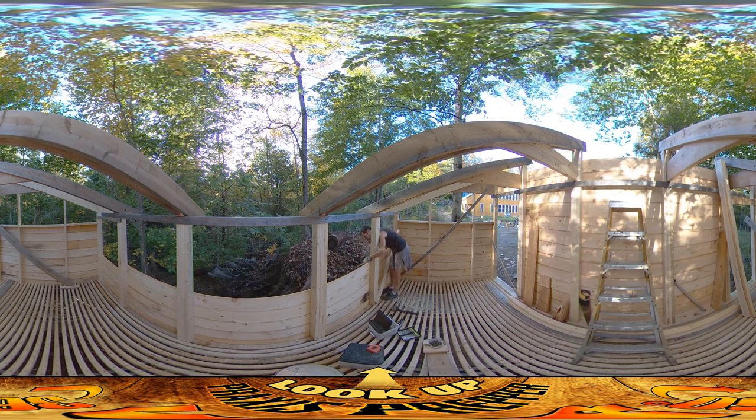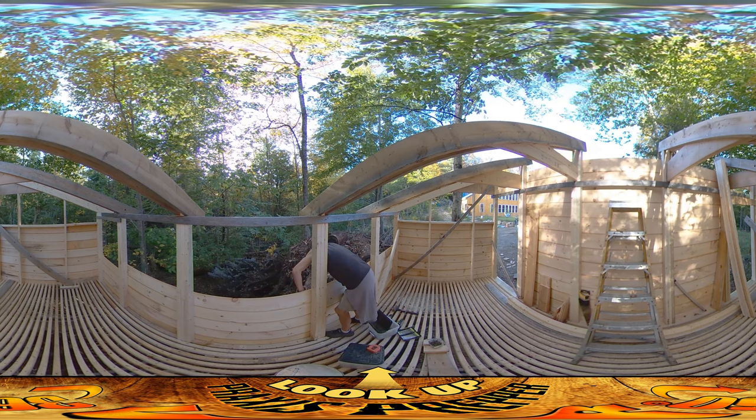The way I'm doing this, I'm leaving a little bit of a gap. I'm putting in a temporary nail and roughly positioning the board. I'm going to line it up over here first — I'm trying to make all the walls match. Not that it matters that much, it's just a wood shed, but may as well make it look pretty. I'm trying to do just little gaps along the run here, so I'm going to put a nail in here and pull it up just a little bit so there's a little bit of a gap.